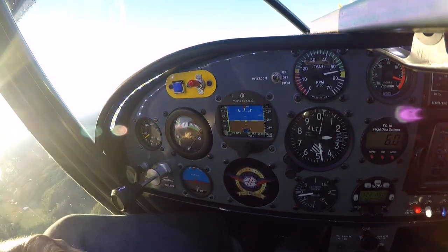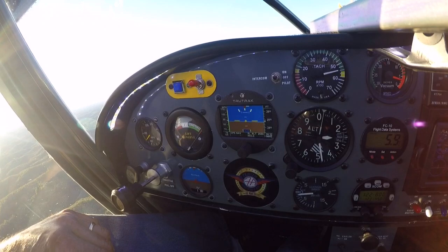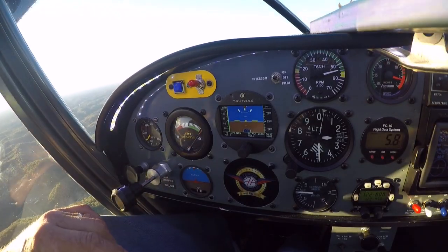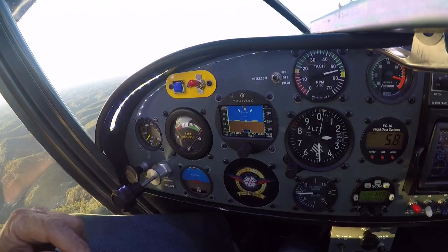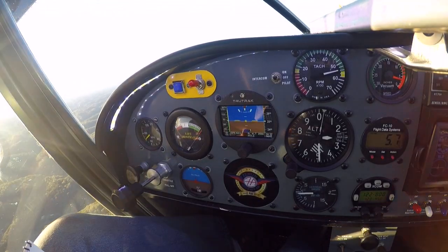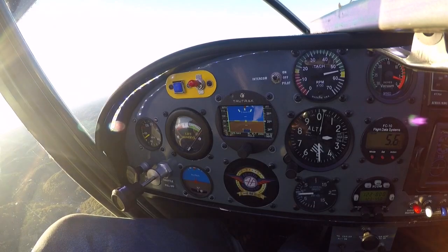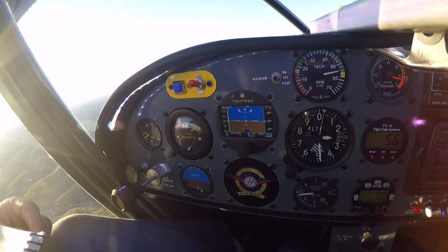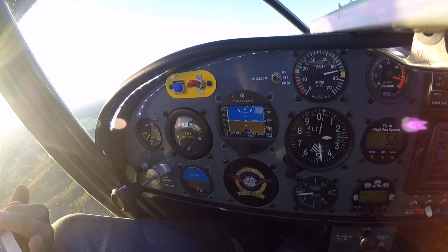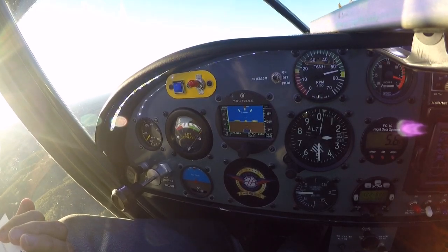It's pretty basic stuff. A lot of people have asked why I put an autopilot in a 701 — that's a whole other subject for another time. I just flew to Mexico, Missouri and back for the Zenith open house — 13 hours and almost all the way there and back on autopilot. It was well worth the money. My 701 only has a Garmin 496, so it doesn't have approach capabilities you'd normally get with a Garmin 430. But the autopilot is capable of doing that — it'll do a GPS vertical approach mode, a missed approach mode, and of course the emergency level mode I mentioned earlier. For the money, the autopilot is well worth it.